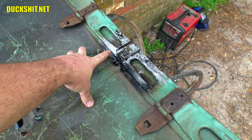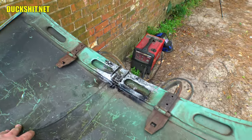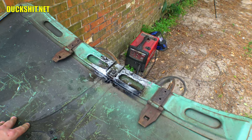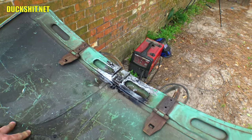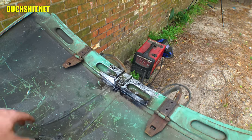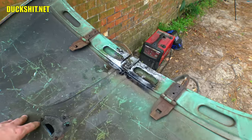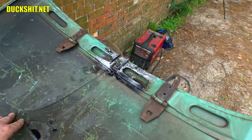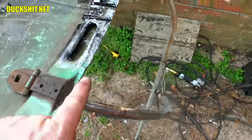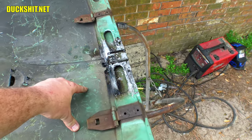You'll notice this is shiny metal over here, and that's because the acid is not reacting with it — the reason why is because that's lead. I experimented with some of Dad's old lead tools, stuff that predates when I was born, sitting in his toolbox as long as I can remember. Much similar to tinning or soldering pipes together, except with a much heavier bigger piece of lead, working with just a blowtorch. It did burn some paint off underneath, but that's not a big deal since this whole thing's getting repainted anyway. That helped solve some of the burn-through holes that the welding had done, because that steel was thinner than most body metal. I went and reinforced the whole underside by welding the two pieces together all the way along that edge. This thing is solid now and should last another 50 years.